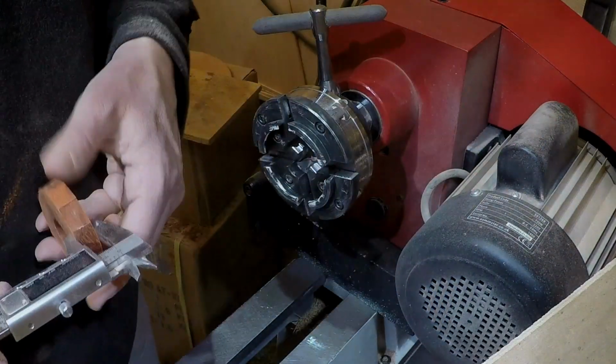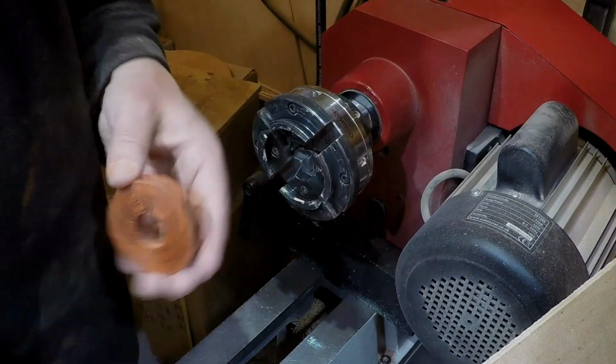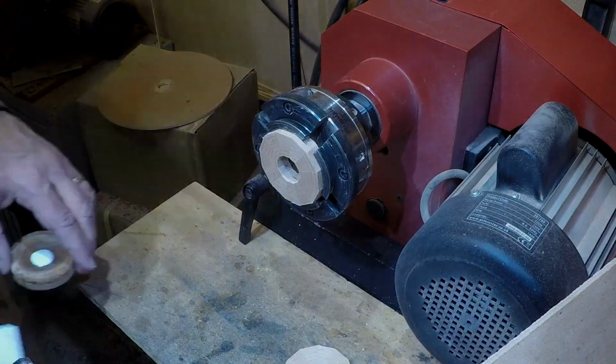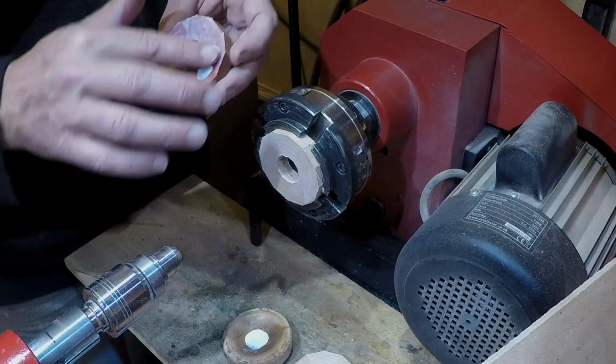They're also made up of 12 segments, exactly the same as the main body is. As they're a lot smaller, I can actually hold these in the standard C jaws to sand them flat on both sides, where I can make sure that they're all the same thickness before gluing them all together.